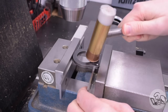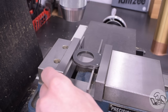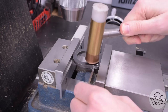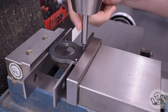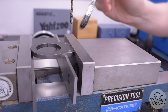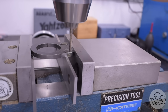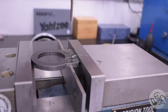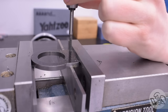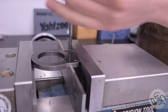Per usual, I make a vain attempt to tap in the piece out of habit, but of course these laser-cut edges are not square, so this is never going to work. Those parallels are not going to get tight, but it makes me feel better to try. My reference for all of these features are these little dimples that have been pre-spotted for us, so I need to line those up on my spindle and get my DRO in sync with where those holes are so that I can drill those out and do the bore relative to those hole positions. We can't use the outsides of the part for reference because this is a laser-cut part, and while lasers seem accurate and high-tech, they're actually not by the standards of machining reference surfaces.